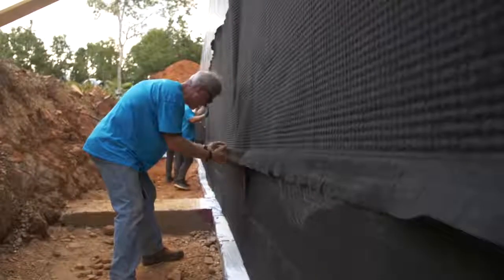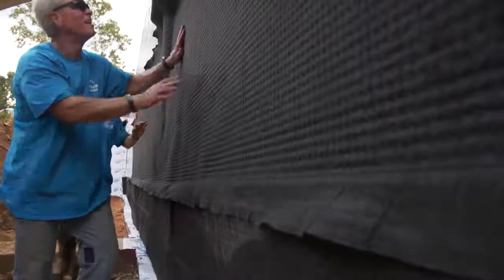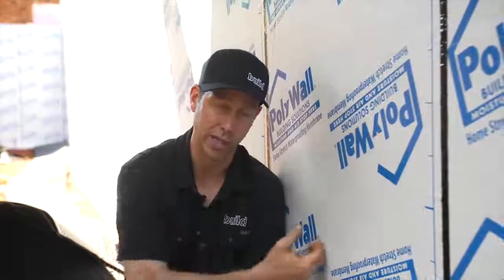Big thanks to our friends at Polywall for sponsoring this series of ICF videos. A little side note: Polywall is employee-owned, and all these products — from the waterproofing to the Arroyo — are all made outside of Ennis, Texas, right outside of Dallas. And the last thing I want to mention is the name. I don't know if you know any Spanish, but 'arroyo' means the ditch — the dry ditch — and that's basically what this product is. We want a channel that when the rain comes, it can run through that dry ditch and right off and out, protecting this foundation so the waterproofing can do its job and we don't have water sitting up against it. For more information on the Polywall system — both the waterproofing and the Arroyo drain — there'll be a link in the description below.